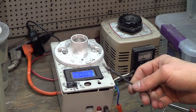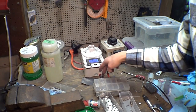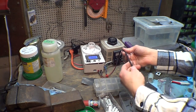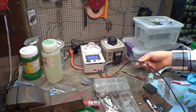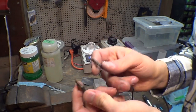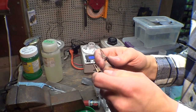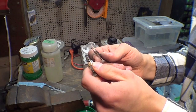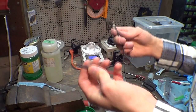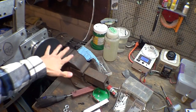There. And that's how we used to drain the power and have to spark it, and it's kind of dumb and dangerous. So then coming out a bit further, out the front, all I have is just two wires, positive and negative wires to a sleeve, just to keep it nice and straight. And then coming out, red and black wires with little alligator clips. After, you know, 2 years of use, these are getting pretty rusty. Not from carbidizing, but from anodizing with the sulfuric acid and stuff. So we gotta get new ones of these, preferably bigger and stronger ones. But anyway, for carbidizing, yep, this is what you need. Same for titanium anodizing.